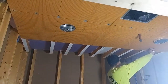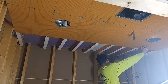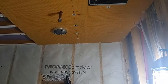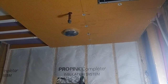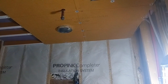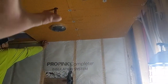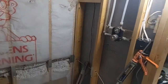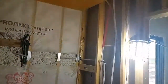Part of that is sloping the ceiling. As you can see, he's cut pieces of that Schluter foam board and the whole shower ceiling actually slants — about a half inch per foot slope, roughly three inches from one side to the other. What that does is the water drains off that surface instead of just sticking to it and soaking in. It's really important that we protect it against all the moisture.